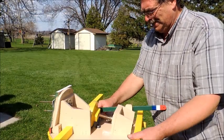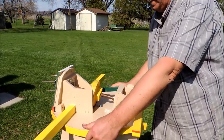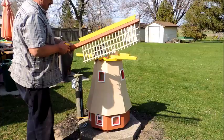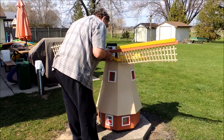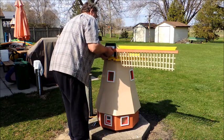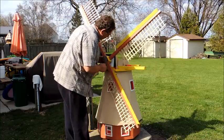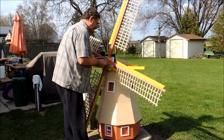I installed the head. Here I'm just loosening the bolt, pointing it into the wind, and then re-tightening it. Here I'm just attaching the hub to the sail and then lining it up on the bolts, just trying to slide it on evenly. Here I've got the other part of the sail on now — got the aluminum plate there and just tightening up the nuts evenly around the perimeter of the plate.